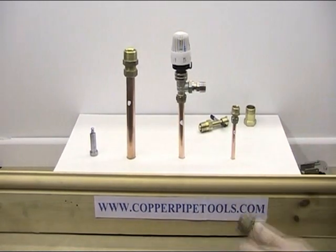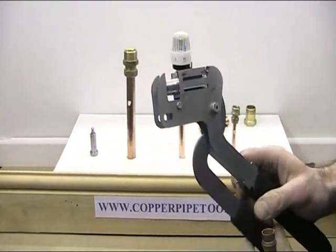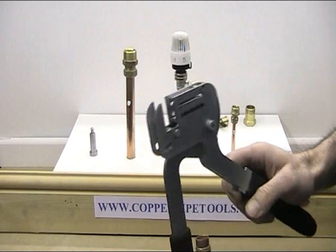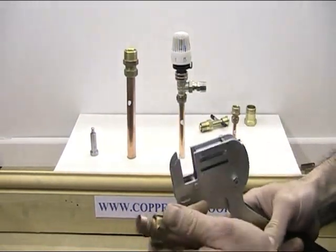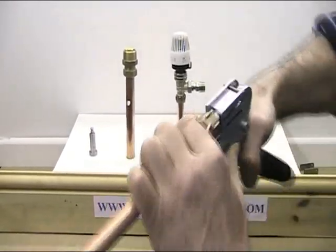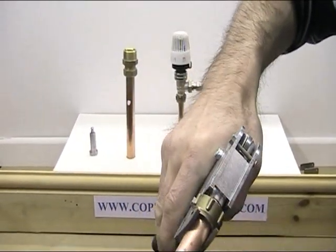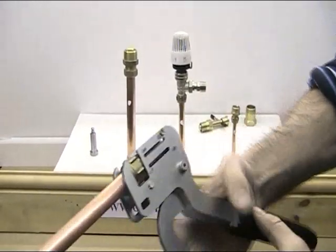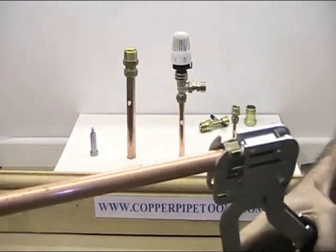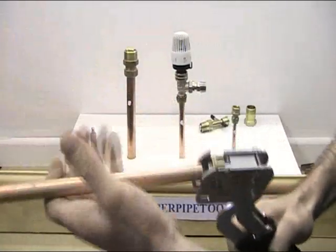What I'm going to show you today is this new tool - the olive pull-off tool. You can see there's a plunger moving in and out relative to the handles. If you pull the handle out, the plunger retracts. This is the same olive here. Place that inside there - the squeeze handle rests on the end of the pipe. All you do then is simply squeeze it together - you need a fair bit of hand strength on this - and it pushes it straight out and off.